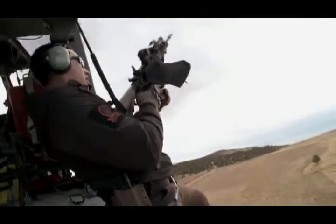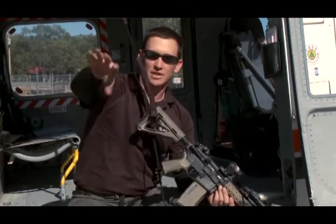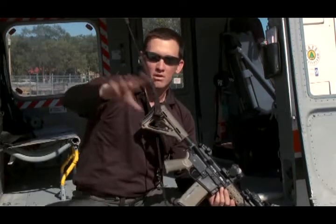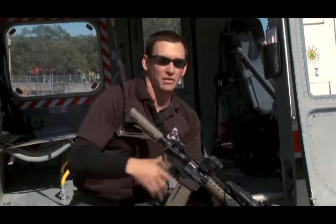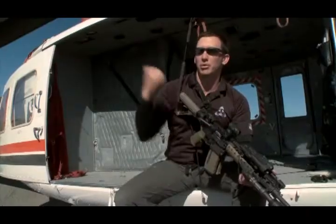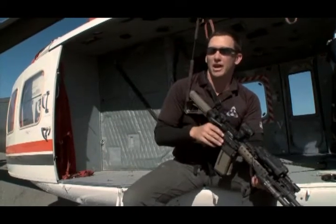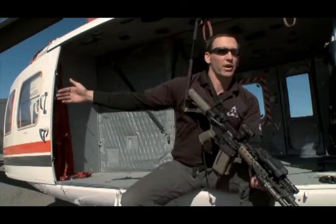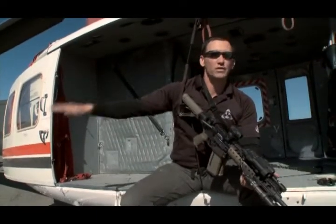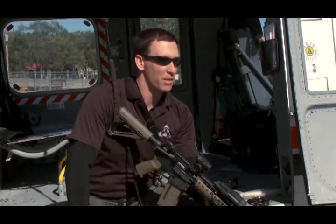Again, reminder, brass even. A piece of brass going into a tail rotor spinning at 5,000, 6,000 RPMs, is that what it runs? 7,000 RPMs will take down an aircraft. I've landed many aircraft in Iraq because we had a piece of brass going into the tail rotor, and you might as well just walk up to it and shoot it. That's how bad a damage it does. And unfortunately in that situation, you're done. Your aerial platform operation is over and you've got to set down immediately and assess that aircraft, make sure it's still flyable to get you home.